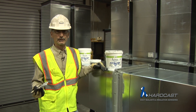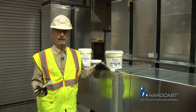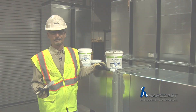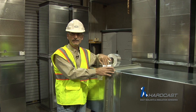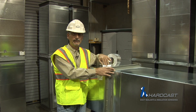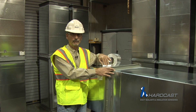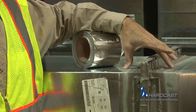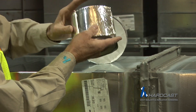I'm going to complete the procedure for the next three sides — then this joint is going to be airtight for the life of the ductwork. We're going to allow this mastic to dry for at least 24 to 48 hours, depending upon temperature, humidity, and airflow. After the mastic has dried, the second part is going to overlay this with the 701.